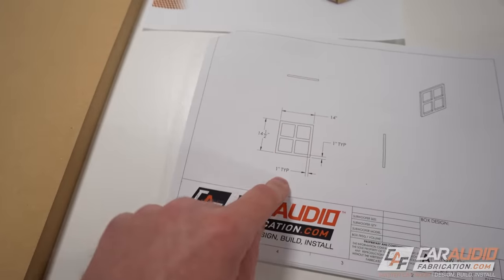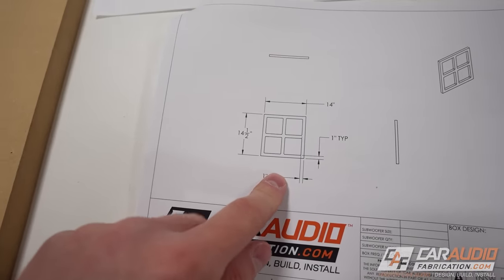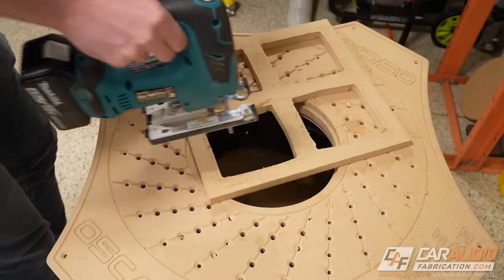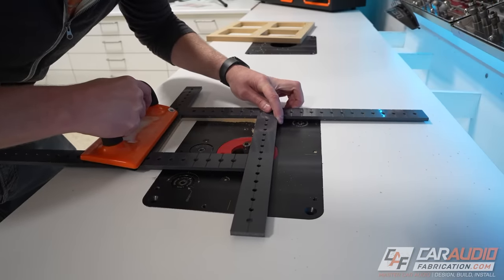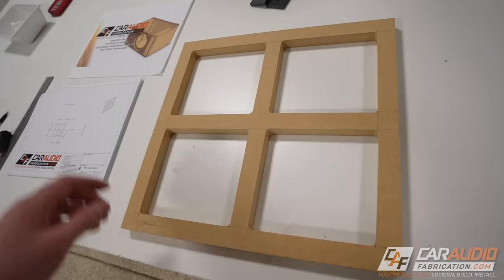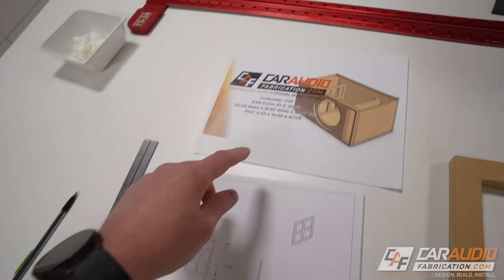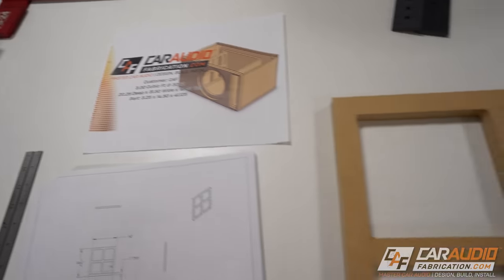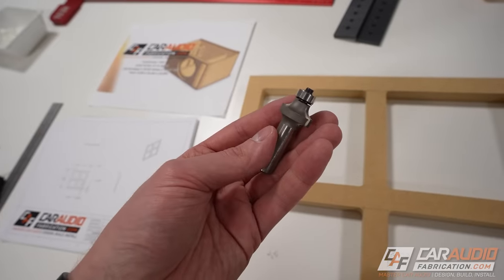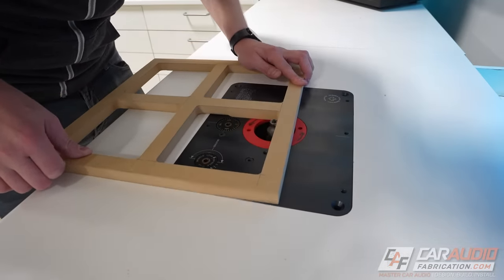With both baffle pieces made, I now need to turn my attention to making the brace that goes on the inside of the enclosure. I'll first use my dimensions to mark up my piece and draw out the layout, then use a drill for a starter hole so I can rough cut using the jigsaw. Then we're going to use straight templates to make each of the cutouts, flush trimming them on the router. Here it is — our completed window brace — which is going to add a ton of strength on the inside of the enclosure as it connects all the different sides together.